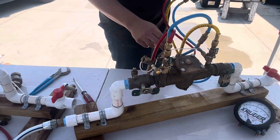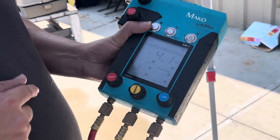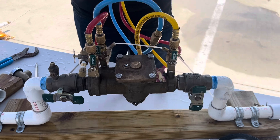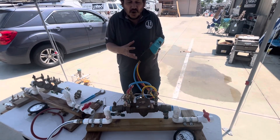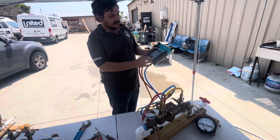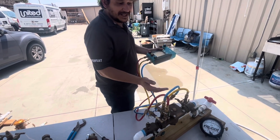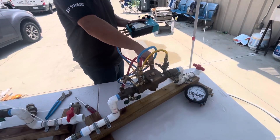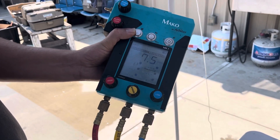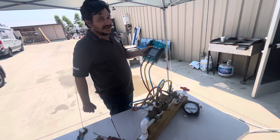The fact that the differential pressure didn't drop to the relief valve opening point tells us that check valve two is working — water is not passing backwards through check two to get into the zone. It did drop a couple, and that's because of disc compression: when we put high pressure onto the back of check two, it pushed check two and reduced the volume of the zone. When you reduce the volume, the pressure goes up, so that's why we're getting an artificially low reading. We opened that to confirm check valve two was working. To get our static differential for check valve two — static meaning not moving — all we do is reset the gauge. Our static differential for check valve one is 7.4. Check valve two is closed tight and the relief valve opens at 3.3.